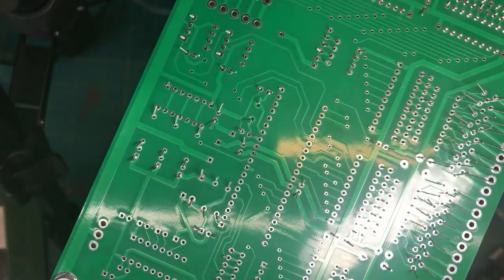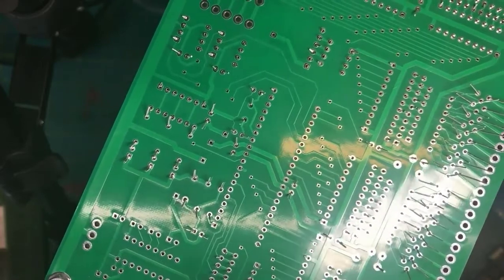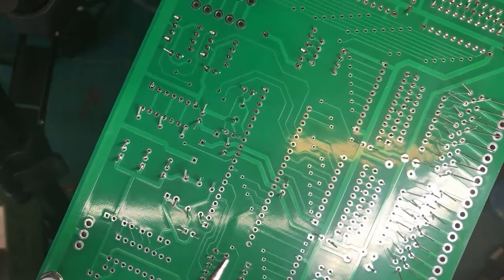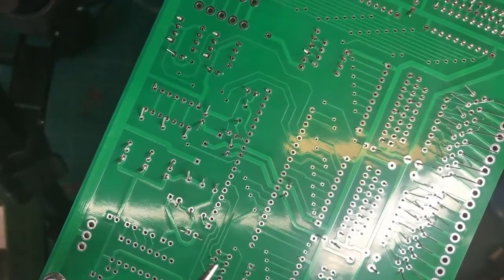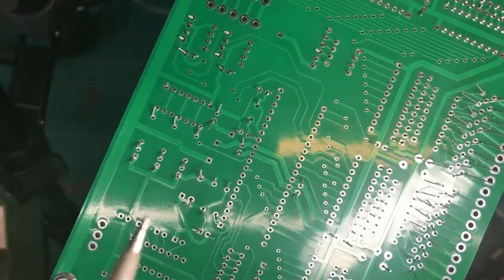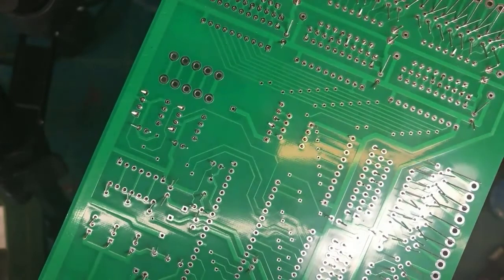Supposedly the bronze wool has two advantages. It doesn't thermally shock the soldering iron tip, which is at like 700-800 degrees, when you touch it to a cold, wet sponge, which would cause it to fail sooner. And also, the sponge cools the tip so it takes a moment to get back up to temperature. I think these issues have more to do with people that are into production soldering rather than the work we do. I used the sponge for years.